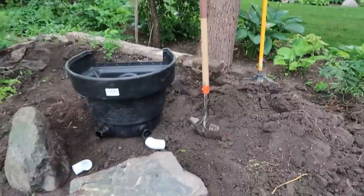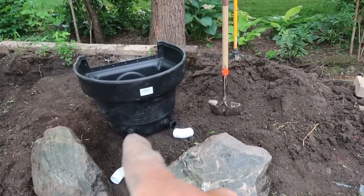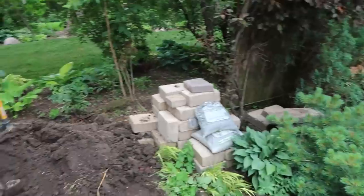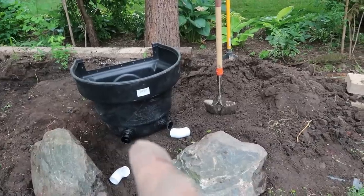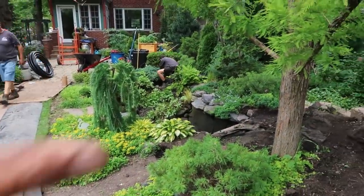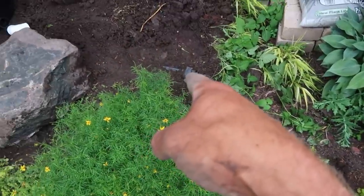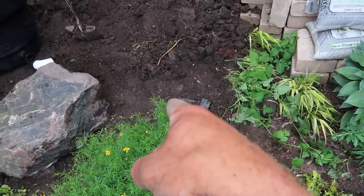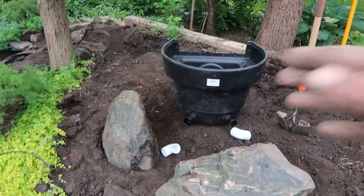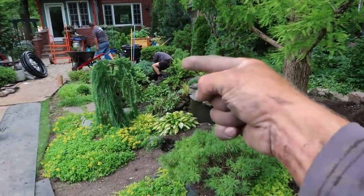We've got the old bio falls out, which ended up being about 36 inches tall. We're going to run an overflow pipe out of this bulkhead fitting with a ball valve somewhere over into here, and then the customer will figure out where to daylight that. He wants to be able to drain this if his pond ever overfills because the way elevations are, he doesn't really have any place currently to do that close to the pond. There's a gate valve there that was attached to the bottom of the previous waterfall box. Our plumbing is going to come in on that side of the bio falls, trench on the inside portion of that wall, and run all the way down into that side of the skimmer over there.